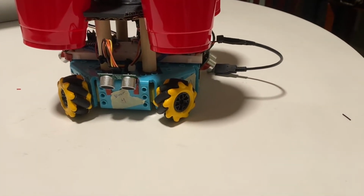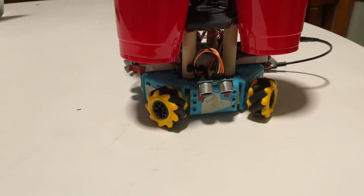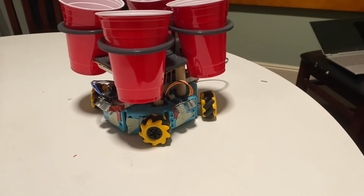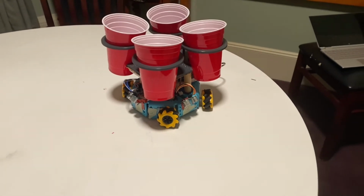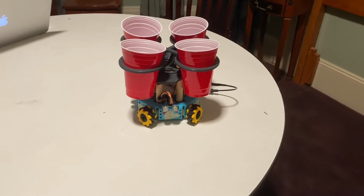First, we utilized an octagonal chassis with four mecanum wheels to enable immediate direction changes without having to necessarily stop and rotate the chassis each time. Next, we positioned the sensors at an angle toward the ground to detect the edge of the table around 3 inches away from the chassis before a wheel would have the chance to cross the edge.